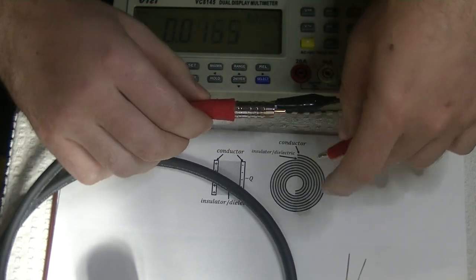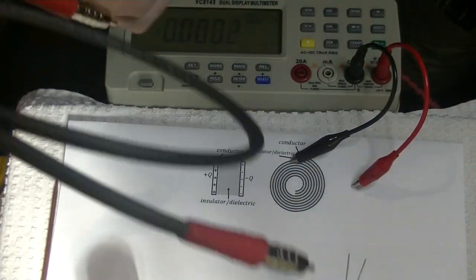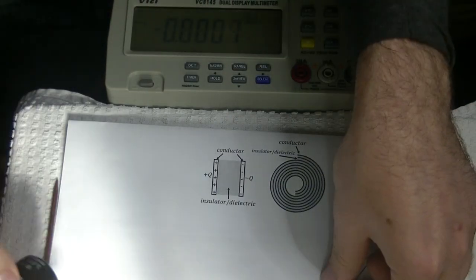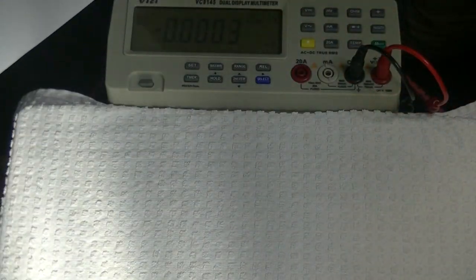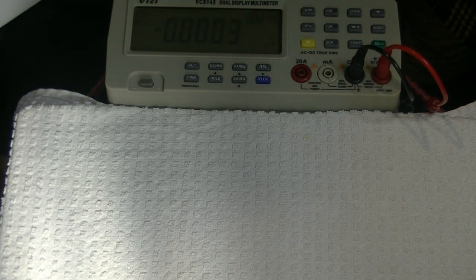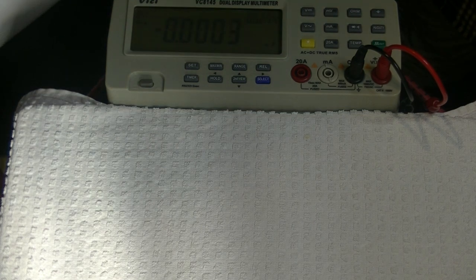Okay, we're going to do another episode at least on this subject, because it's huge. It really can make a difference in a system. But if we were to take away a couple of things to pay attention to in your system, what would they be, Charles? Well, the length of the cables is extremely important. You want the cables to be sized for the purpose, and you don't want them to be any longer than they need to be.